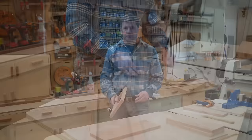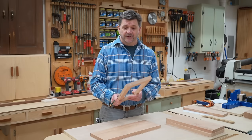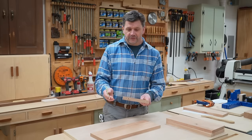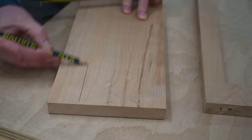I'm building this table with pocket hole screws. I know some people have a problem with pocket hole screws, but if you do, you could also build this table with mortise and tenon — the only thing you'd have to do is add an inch and a half to the length of the aprons. I have a mortising machine, but not everybody does, and I felt this project would be more approachable with pocket hole joinery. Now that I have my parts cut to size, the next step is to drill the holes, and I'm going to stagger the holes so the screws don't meet in the legs. For the front and back aprons, I'll measure over from each side and draw a line at an inch and three quarters; for the side aprons, I'll measure over an inch and a quarter.